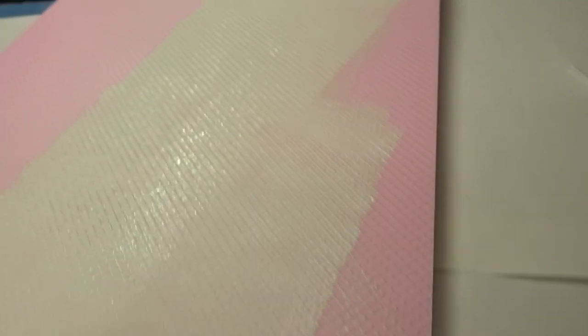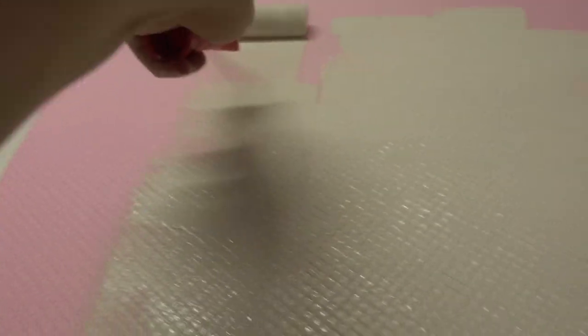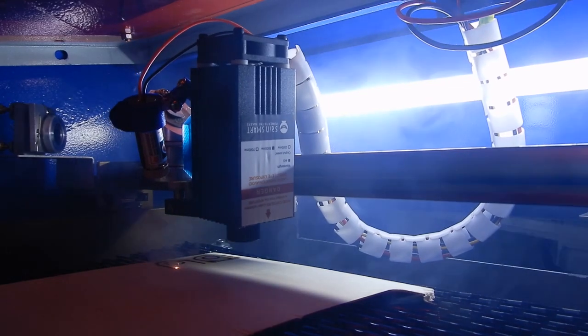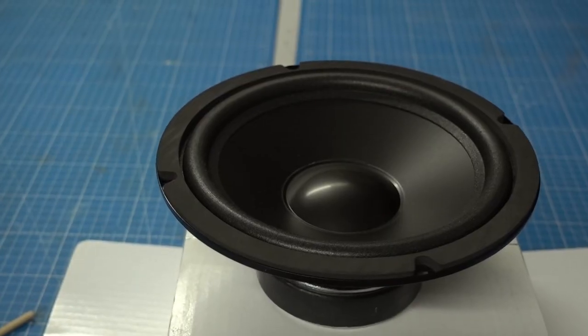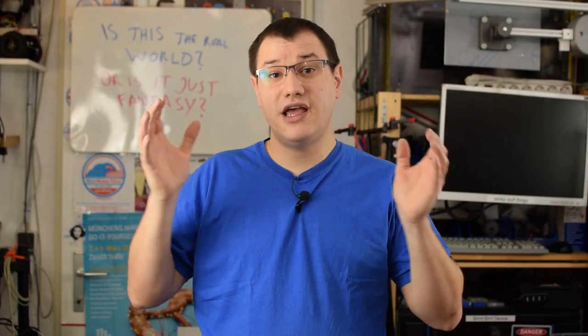Volume, loudness, and sound pressure are independent measurements. The only thing that you can really measure is sound pressure, but that is not an indication of the loudness that you perceive. That's a subjective value. The big membranes are optimized for the frequency range of human hearing in the human voice range. These are the mid frequencies, the low mids, and the high mids.